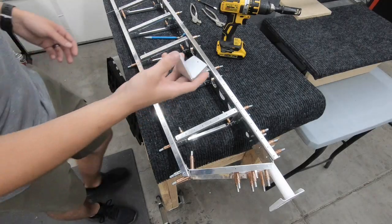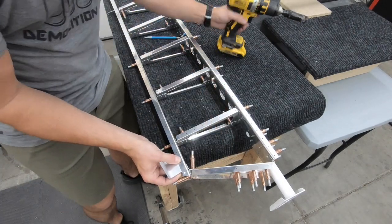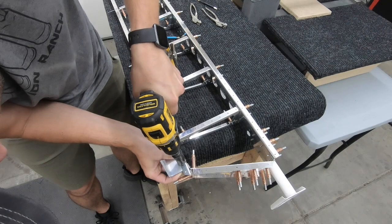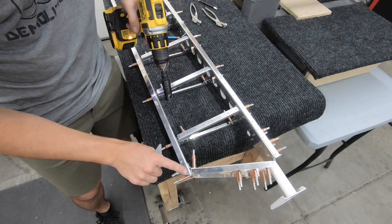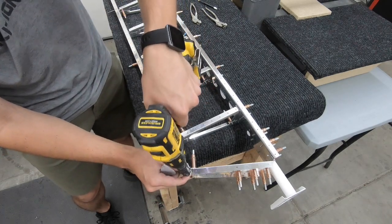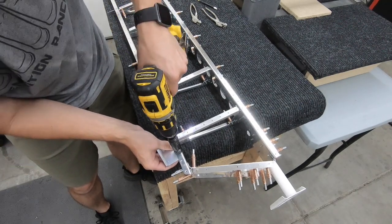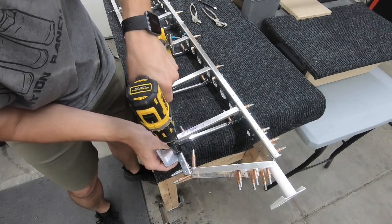Yeah, so you literally just have to take this material here, line it up underneath there, and take your countersinker, get it set, and it holds it nice and steady. These ones on the edge are harder to do. It has the option of kind of rolling over that edge, which is what causes that chatter there. But on a nice smooth surface like these here, I have a pretty good success rate of minimal chatter and nice and straight countersink.